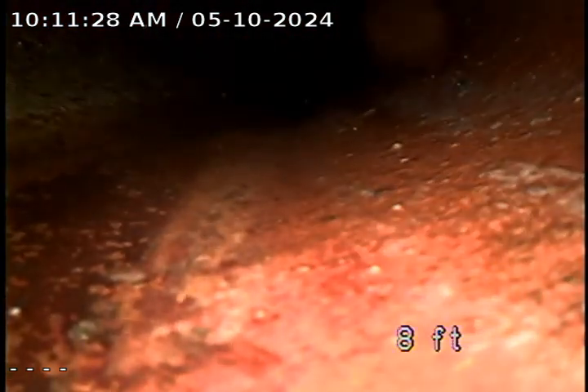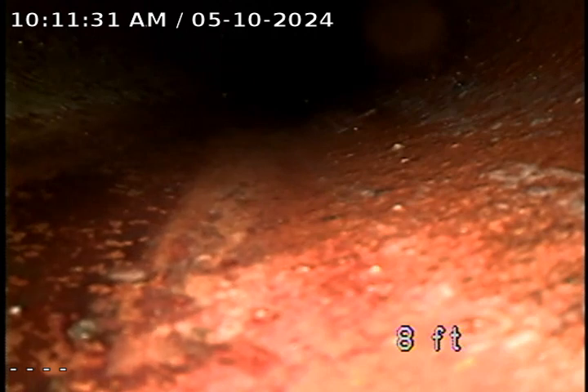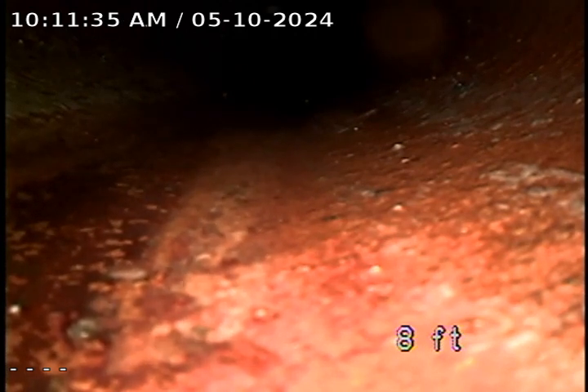As you can see, we just transitioned from the four-inch cast to six-inch clay. The line's in pretty good condition — didn't see any structural problems at this time. There wasn't anything other than the calcite buildup on one of the joints.